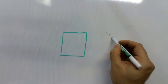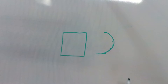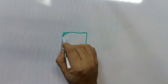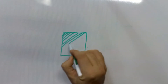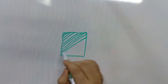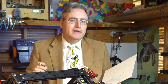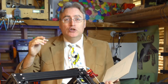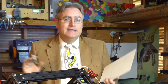For curves, it would be most ideal if it could track to the top of that curve — a series of small lines starting at the very beginning of the curve and going through that whole motion. That of course means infill is going to be a very slow process because it can only draw the infill in one direction and it's lifting up between motions. There is some potential for optimization here, but I think the general idea might work. And if that's implemented, then a CR-30 or other belt 3D printer with the nozzle at an angle could potentially print layer by layer without needing any additional hardware.